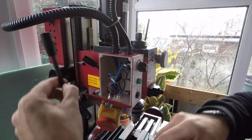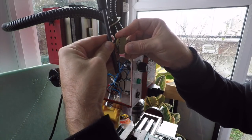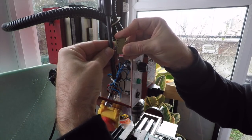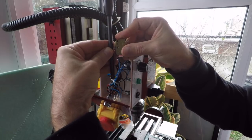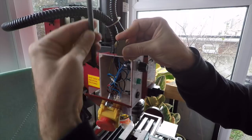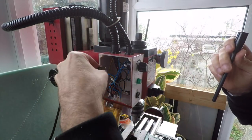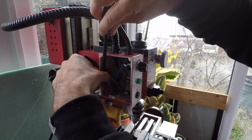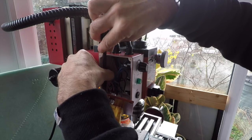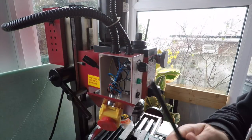And I can have something like a little micro switch, so the bar actually activates the micro switch when it's gone in, and that will connect the power so the machine can be in use. If I take that out, that will disconnect the power. Yeah, I think maybe putting that inside there and having the bar run through a hole, click power on, click power off. That's got to be the answer.